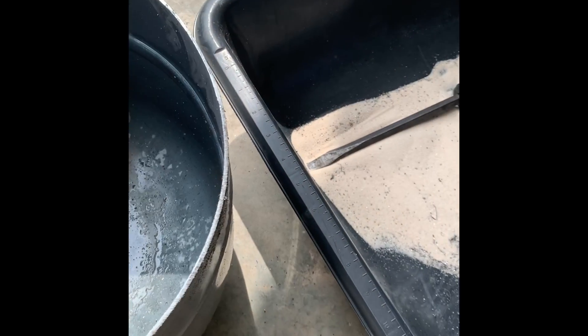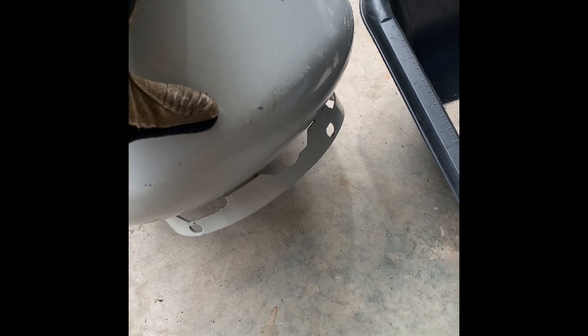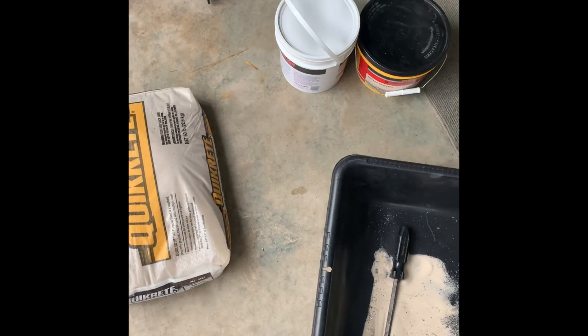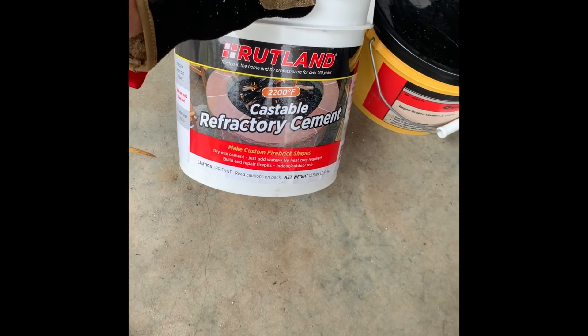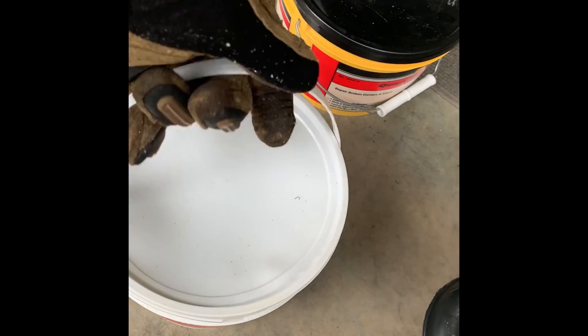Now I'm gonna figure out the kiln part first. I'm gonna drill a hole in the side, probably somewhere here at an angle, find a pipe to run through it so when I do all the cement mix I won't have to chisel out any concrete — it'll just be a solid hole ready for the pipe. I went ahead and got refractory cement right here, which stands up to 2200 degrees. It's about 20 bucks for around 12 and a half pounds.